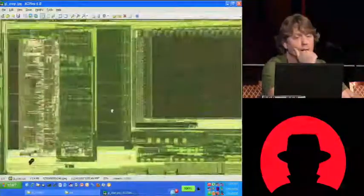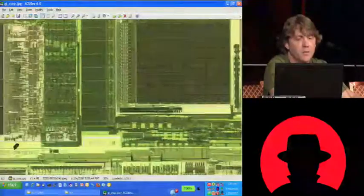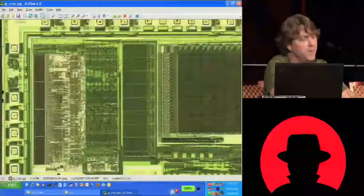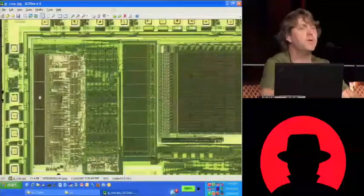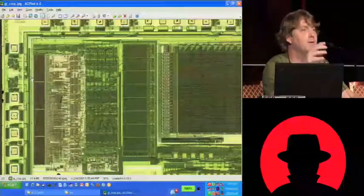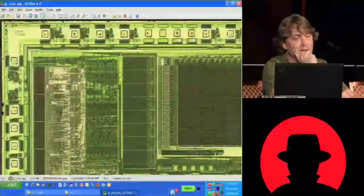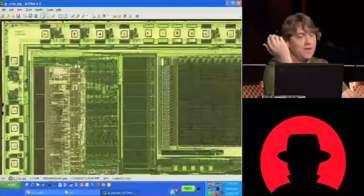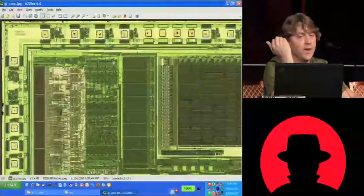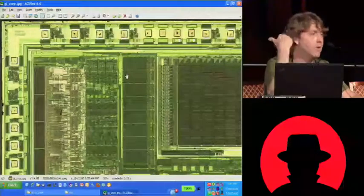And so you look at it, and you've got some non-volatile memory here. You've got some static RAM. You've got more static RAM. And then here's the core, and look what we see here. What's this? Who can say what this is? I discussed this before. Micro or PLA, one of the two. So instruction registers are somewhere in this area, and they're right here. So there's your 8 registers. Freeze the latch, dump the whole chip.